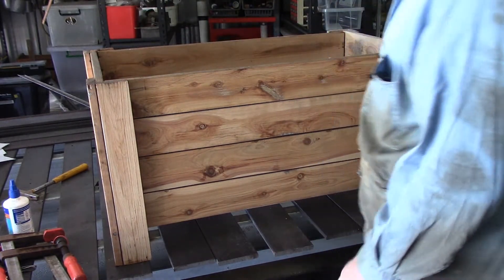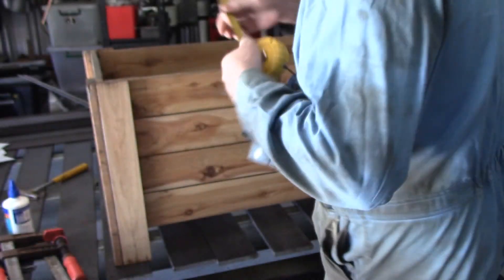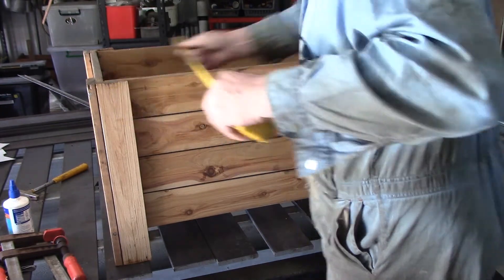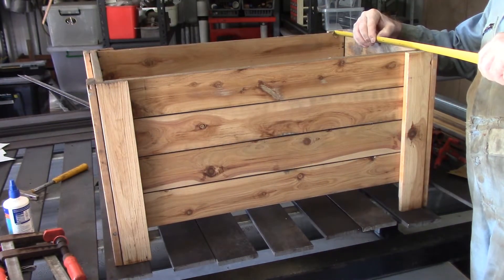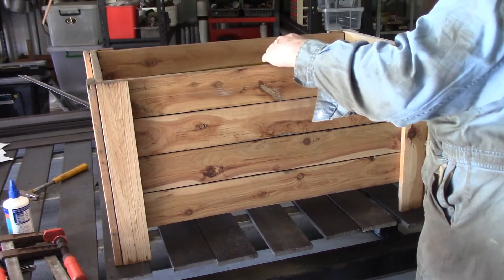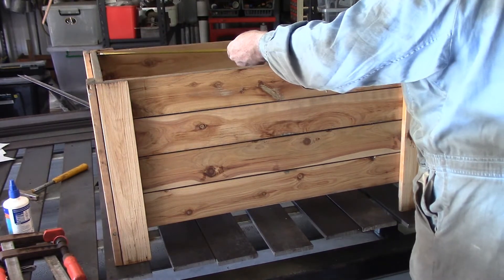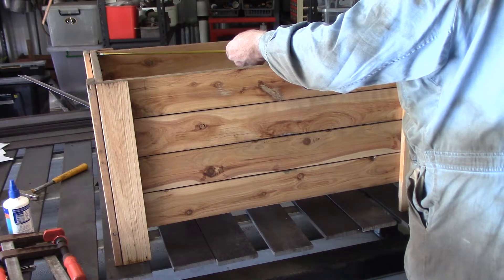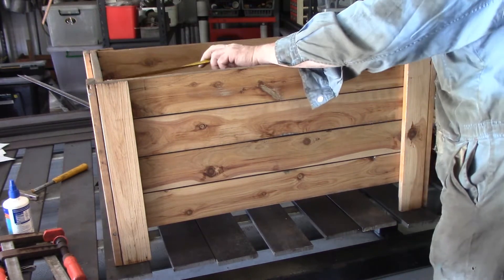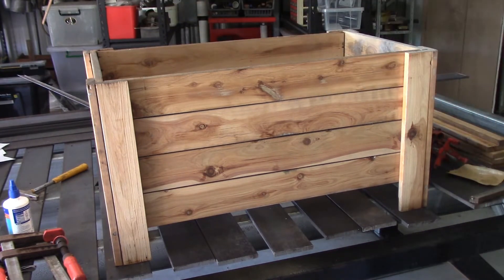Next job's the floor, and to do that I need a tape measure. Checking the box: we have 403mm and 402.5mm — half a millimetre out that way, I can live with that. 762 and 763 — one millimetre out that way. And that is 852 and 853 — one millimetre out of square, which is just a shade over a 32nd of an inch. So I can live with that, that'll work.